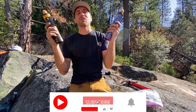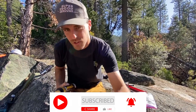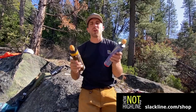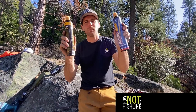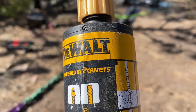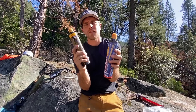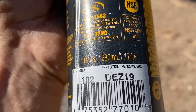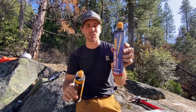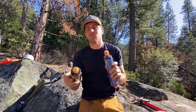I'm Ryan Jinx, and welcome to the middle of nowhere where we are testing some bolts. One of the tests we're going to do for this episode is to test a 10mm solid leg bolt with a welded eye from boltproducts.com. We're testing it with vinyl ester — the popular AC100 Gold. It used to be owned by Powers and now it's owned by Dewalt. This one says May 2017 expiry and this one says December 2019, so one is one year four months expired and the other is almost four years expired. We'll do two holes with the older one and one hole with the newer one, and we'll pull in tension — straight out — because that is worst case scenario.